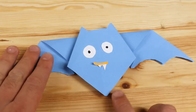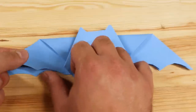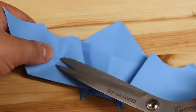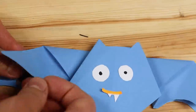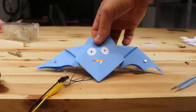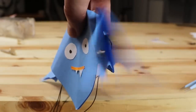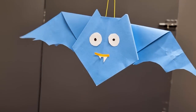I have two bats and a skeleton. This one is pretty simple to implement, because all we have to do is put a coil over here and a magnet on the other side, and this way the two wings should flap. The tricky part is going to be passing the wires, so I'm just going to make a hole here. I think this makes for a great Halloween prop, because you can enclose everything in a 3D printed case and also use the coils as a speaker.